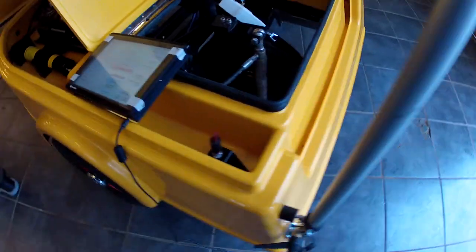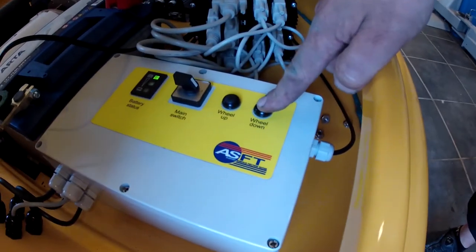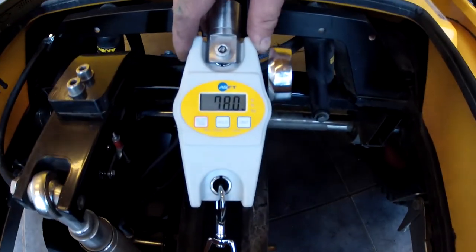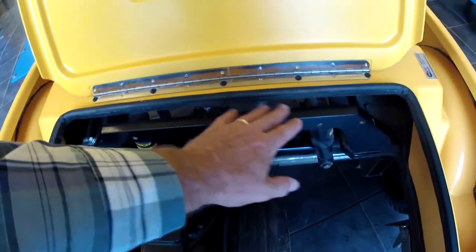The test sensors step needs to be done to verify that the friction calibration is good. The buttons on the side of the T5 on the electronic control unit can move the wheel up and down quicker to get to a checkpoint. Here you can see it's been lowered and is showing 77 kilograms — that matches what's on the computer. It's OK.